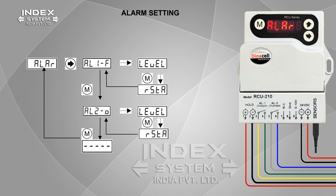Alarm setting. Press M to go to the alarm submenu and access its parameters by pressing the right arrow. Select Alarm 1F, then press right arrow. Select Level, then press right arrow. Set the full load alarm limit level according to the passenger capacity, using the right arrow to shift the digit and the up arrow to change the number. For example, if your lift is 6 passengers, put 408 kilograms as the overload capacity. Press M twice to save the value.